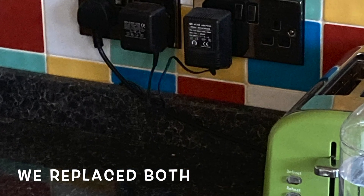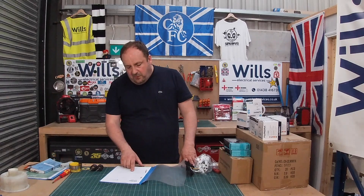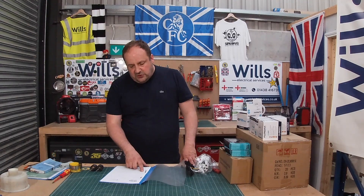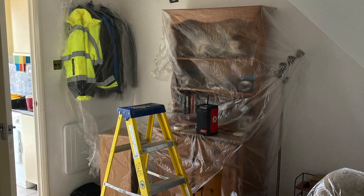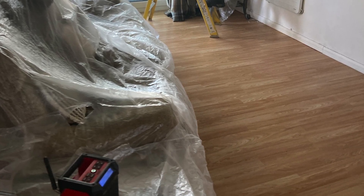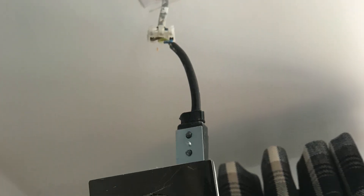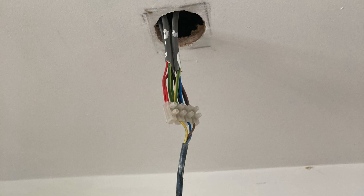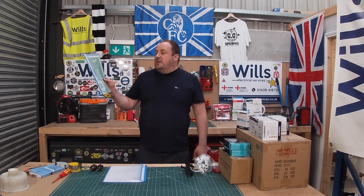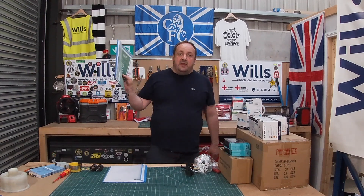The next observation: living room and kitchen have no fire hoods fitted with open-back downlights on the ground floor with rooms above. Regulation 527-1-2-19 — 19 of them need to be changed to fire-rated white bezels. I've got the metal bezels because there are satin chrome square ones in there that are really awful. One of them is an absolute prime candidate — it has unsatisfactory connections.